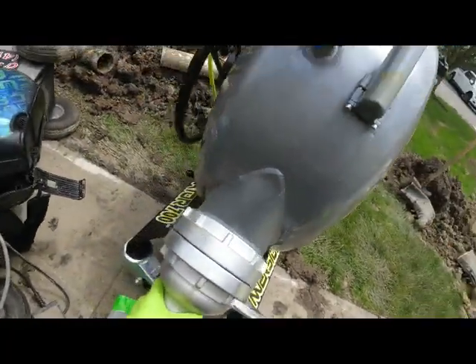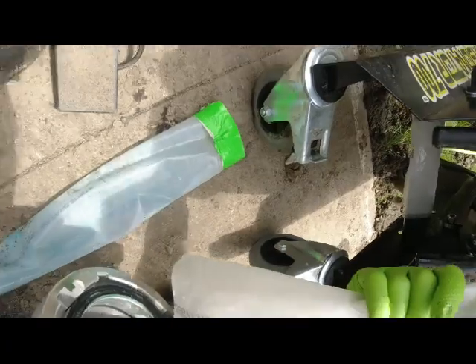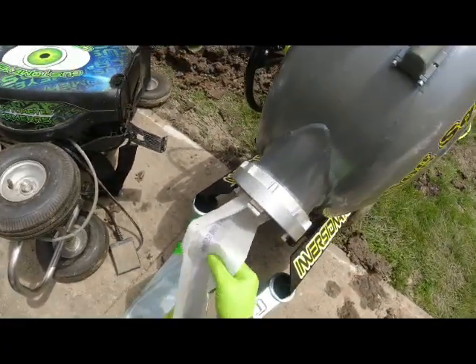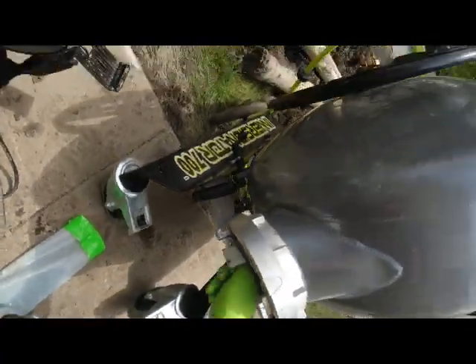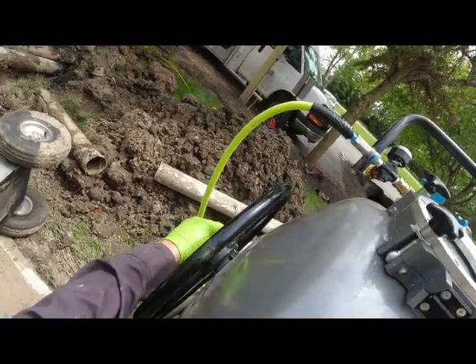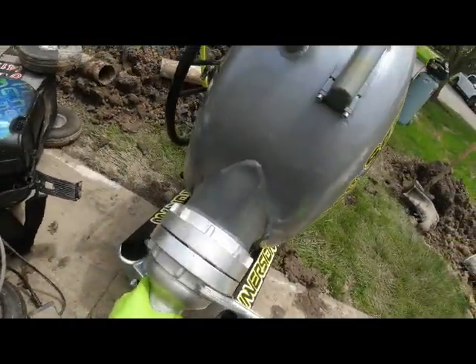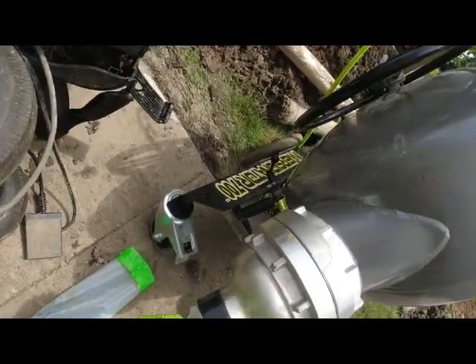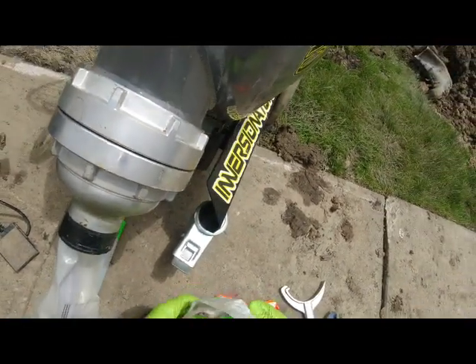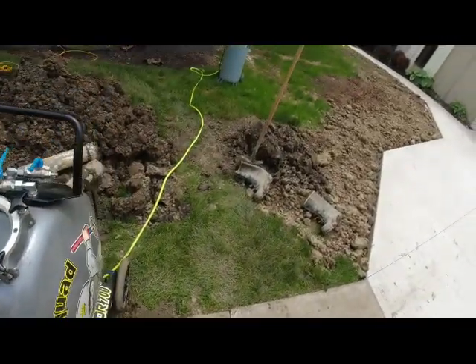After this is to get it ready to cure, harden, and set in place. I've already loaded up this calibration tube — cal tube as we call it — which will invert inside the liner, and we'll get hot water pumping through it. That's another video in itself, and it'll cure over the course of about an hour and a half or two. Then we'll have a new pipe inside the old one. So this is how it starts: you fold it over back on itself, clamp it to the nozzle, and the inner part of the liner rolls out through itself, inside out — it's wild but so cool.